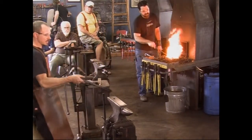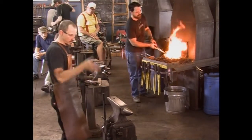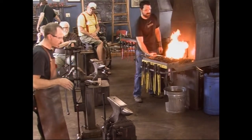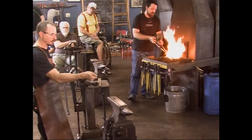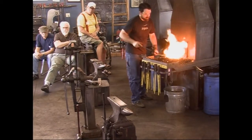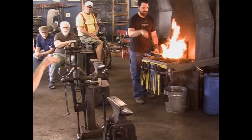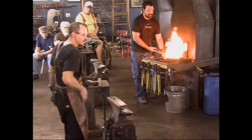There's one thing missing on that tool that I normally do with power hammer tools. The handle on it is turned vertical. I did that just for strength there. Normally I don't do that. The flat bar handles are flat when you're holding them. I take them in the drawing dies, heat them up, and pinch a thin spot in there, about 1/8 of an inch or so, and that acts a little bit like a spring. That helps take some of the shock away. I didn't add this in on this one.